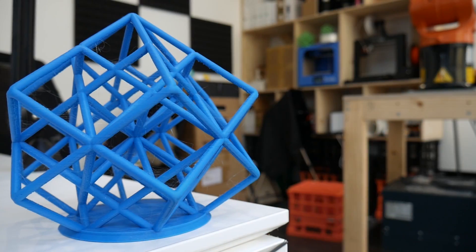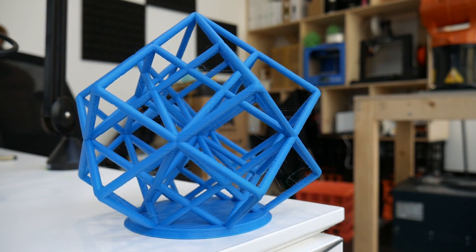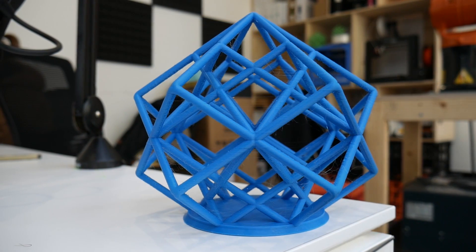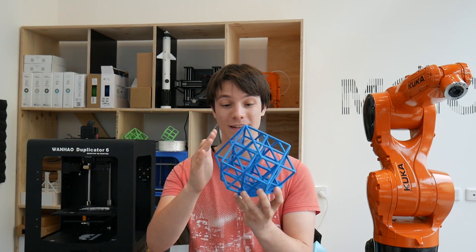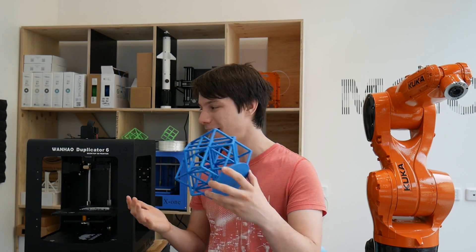What about something in between — what about PET? It actually seems to print PET really well. My torture test scaled up a little bit shows a bit of stringing, which is common with PET and expected given the cooling issue, but the layers are nice and tight, the undersides are better than the PLA prints, and overall it's a really good result on a difficult print.